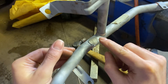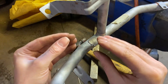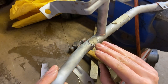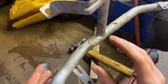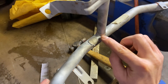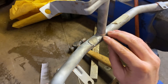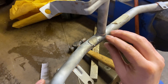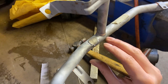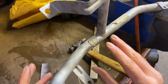I'll drop that on just like so, and I can wipe away the excess now because otherwise we'll have silver solder flowing everywhere. Going to wipe away the excess quickly and get the heat on. This should be a lot quicker because everything's nice and thin. I need to be careful to avoid this area so we don't melt the previous joint. With how quickly we're going to heat this, heat creep probably won't be an issue. Put some heat on, get some solder in, and that should stick just nice.